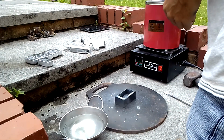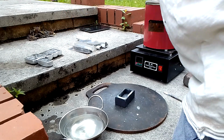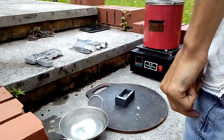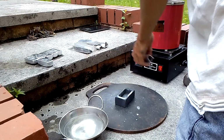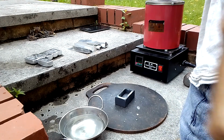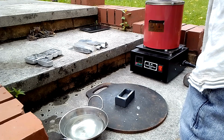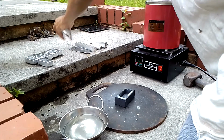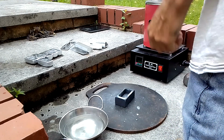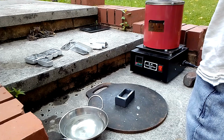Right, let's feed some more to the furnace. One at a time. Wow, that one just completely disappeared. And that one. Cool. It was very quick melt speed today. Quite thin aluminium, if it's quite thick, probably a bit longer. Indeed. Another bit. Got some flaming. That's impurities burning off. And paint. So, nothing too exotic.